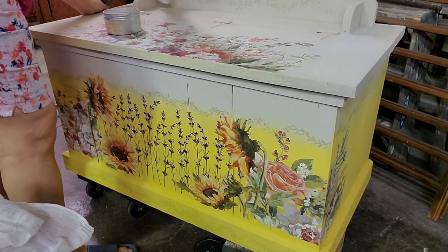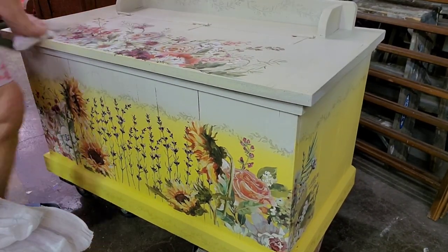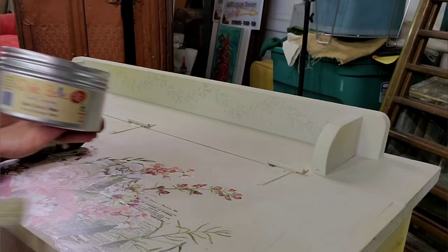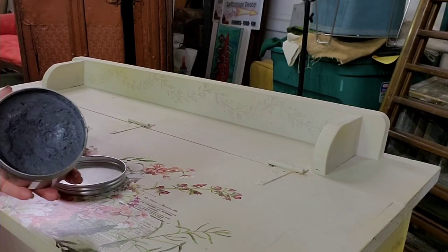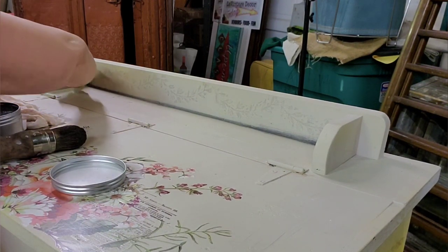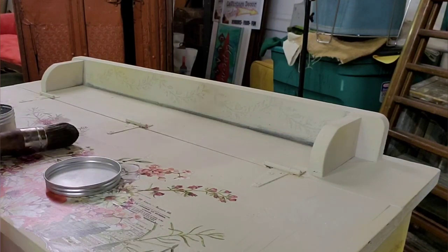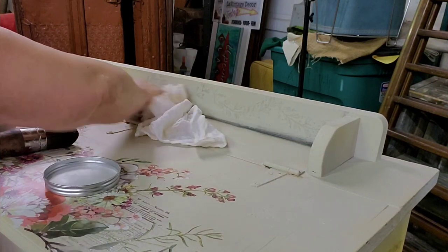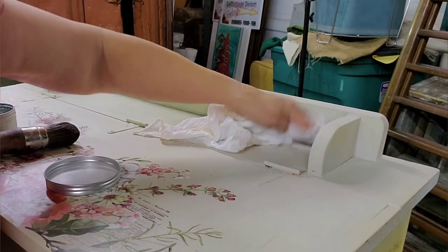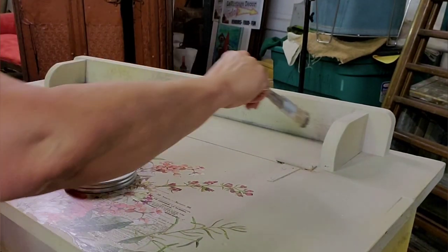I'm using the Best Dang Brush from Dixie Belle — it's an awesome brush for using clear wax when you're going all over the piece because it's a great big brush and it covers a lot of territory. Next, I'm going to use Dixie Belle's Grunge Gray Wax and a much smaller stencil brush, and I'm going to go in all of the crevices and cracks and put a nice aged finish on here. It's great to use clear wax underneath your colored wax, because now I can take the same rag I used to wipe back my clear wax and wipe back the Grunge Gray — that softens it and allows me to remove it in areas where I got a little too much. After all, this piece is very dainty and delicate, so we don't want harsh wax.